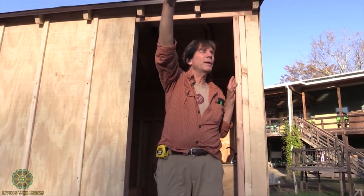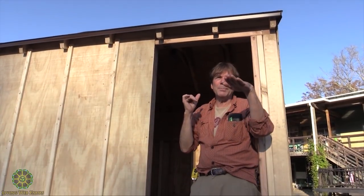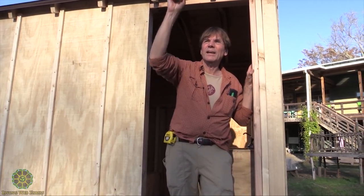It measures the amperage and the voltage as the sun goes behind a cloud, or the sun's not putting out much power because we're not in the window and it's getting through trees. As the voltage drops, it adjusts the amperage. It was not intended to be a class on solar, but this extends the life of the batteries because it doesn't waste any energy. In milliseconds, it's measuring and analyzing what the sun is giving it and what the demand is at the moment, and balancing those to the best of its ability until the sun goes away, and then it'll happen again tomorrow.